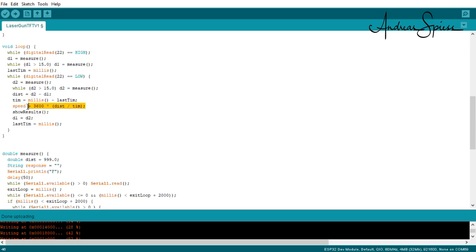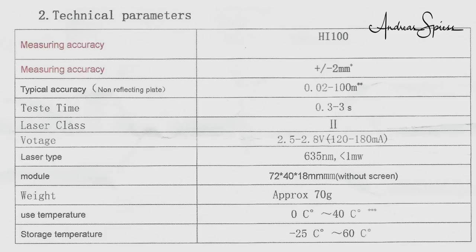Delta time can be found if we use the millis counter and calculate the time between the measurements. So, we can not only display distance, but also speed. To run it at full speed, we have to send the start letter, wait for the complete response, and immediately after that post the next start letter. But how fast is full speed? The datasheet says 0.3 to 3 seconds, and really the time between two shots is around 0.3 seconds — we get 3 measurements per second.